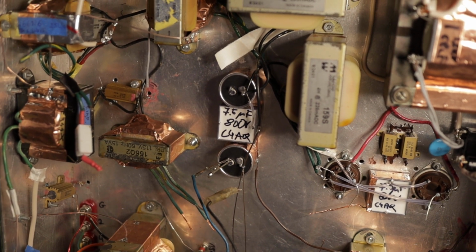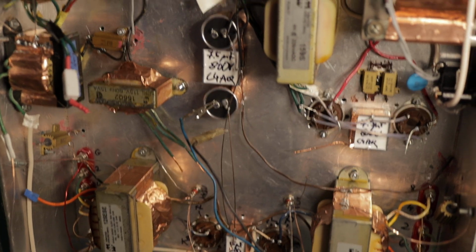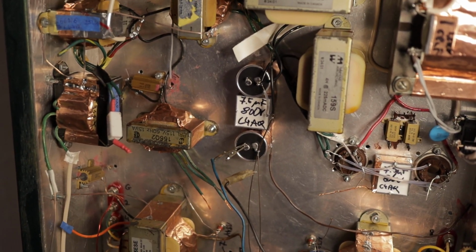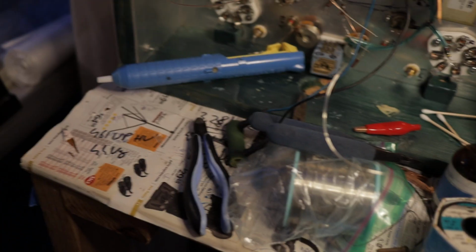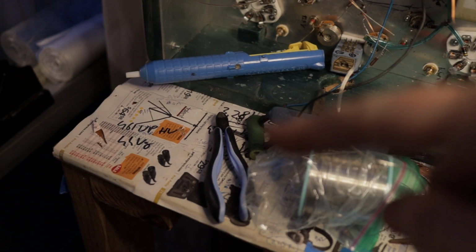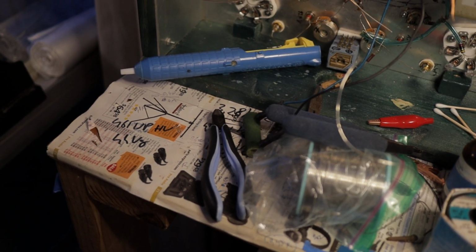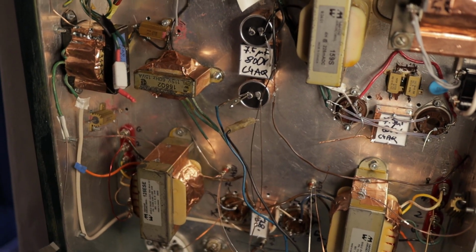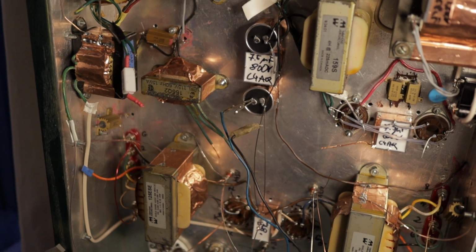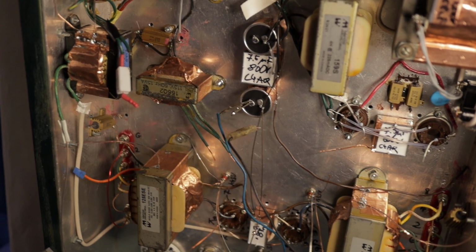And then make sure that when you turn on the amp, remove the bleeder first, because if you leave it on, it will continuously try to bleed the voltage, and most likely the rating will be insufficient for your resistor, so it will heat up. And I have seen a bleeder that was left on an operating unit just turn bright red, and I dived for the power switch to turn the power off before it blew up or melted and created a fire. So yep, that can happen. Learn from it. Never leave the bleeder on when you are ready to test the unit. So before you test, remove the bleeder. Before you work, attach the bleeder. And before you do anything, measure the voltages with a multimeter.